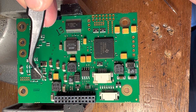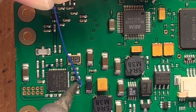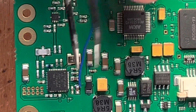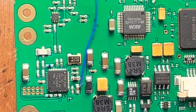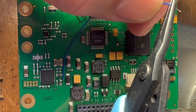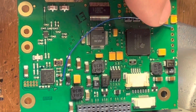We're going from this inside edge of this component right here, and it's going to travel over to this spot right here. I've bent my end into like a little hockey stick, and I'm going to try to run it on the inside of that there and give it some heat. I pushed it back a little bit. I tinned both ends before I attached either — strip them, then tin them. I'm going to bend this a little bit to make it sort of almost like a right angle to help it drop right into that hole. Dry fit it like that, and then I'm going to hit it from the other side and solder.